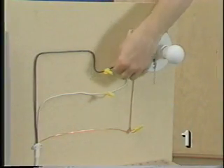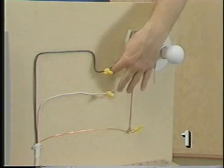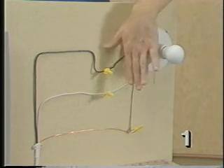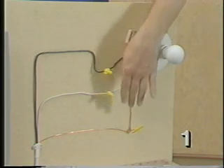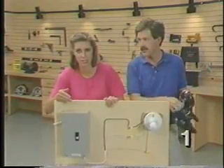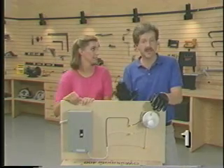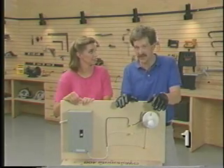For example, if the hot lead and the neutral lead were accidentally connected, it creates a situation called a short circuit. Current will take the easiest path available, bypassing the bulb and taking the direct route back to the neutral — the short circuit. This means current is flowing through the wires without the resistance of a load, creating a large current flow. It's kind of like putting your car in neutral and pressing the accelerator all the way down — without the resistance of moving the car, the engine runs much faster than designed, causing parts to overheat and break. A short circuit can cause the same sort of damage by overheating the wires and burning the insulation.